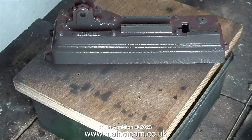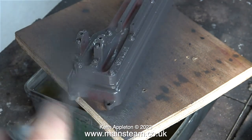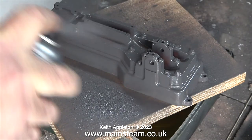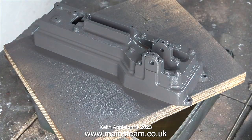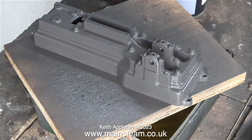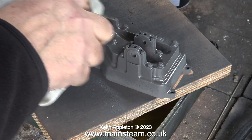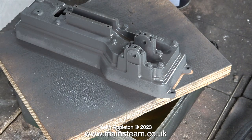In the outer part of the workshop I'm painting the casting using some etch primer. Normally I would be concerned about the etch primer reacting with the paint underneath, but no worries here — I have no idea what the red primer paint was; all I can say is it's really good stuff. I didn't bother masking off the crosshead guides; all I did was use a little bit of cellulose thinners on a cloth to wipe away the paint from that area.